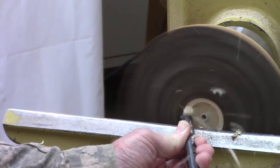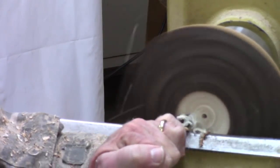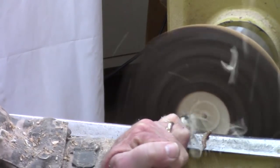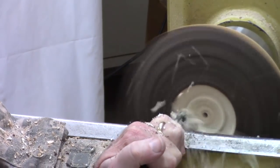I've got to clear it several times to get rid of excess wood — you don't want it to bind. Now I'm beginning to make my entry cut. It's good to practice each of these entry cuts because you want to slice through that bark. With each successive cut, slice into the bark to get that nice clean cut. I'm going to hollow out the middle a bit but not go all the way to the bottom, because I want a certain amount of mass while I work the outer edge. Most any kind of wood will work — I tend to like Bradford pear for natural edge bowls, but this cherry log should work well. The bark looked like it was in real good shape and it was very green.